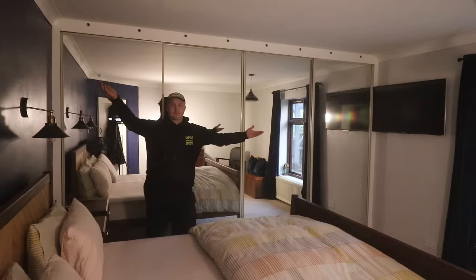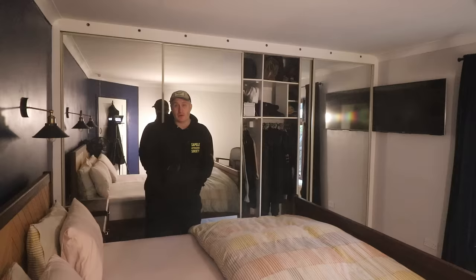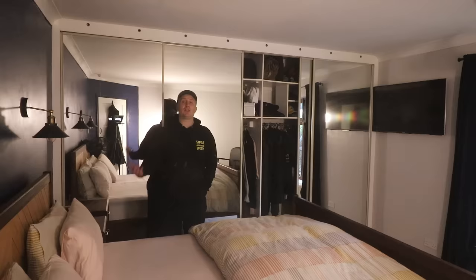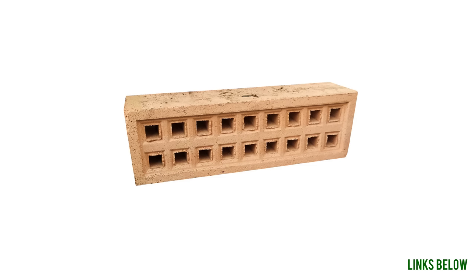The biggest problem in this room was with our fitted wardrobes. The walls at the back of the wardrobe were covered in mould and mildew when we moved in, definitely not the sort of place you want to be storing your clean clothes. The problem with areas like this that are behind closed doors is a lack of ventilation and airflow, because good airflow allows the humid air to be displaced by fresh air which keeps things dry.